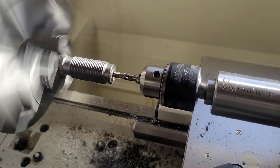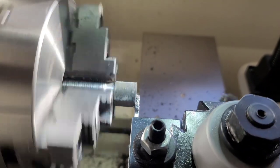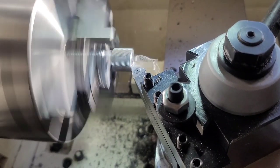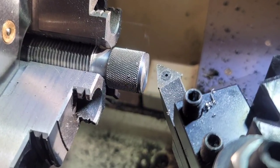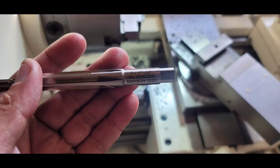Since this blank is unpiloted, I had to drill my own hole and then ream it out to .242. Using high-speed steel bits and cutting oil it made quick work drilling all the way through. I then parted off the excess material — that little piece that breaks off is actually great to keep for making thread protectors. After that I faced off the top of the die and cut off a little of the knurling for a more aesthetic look. To make the sizing chamber I'm using a sizing reamer made by Dave Manson, chambered in 6x47 Lapua.